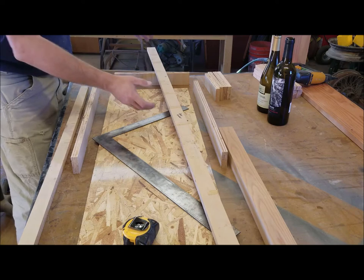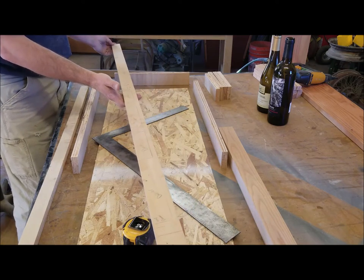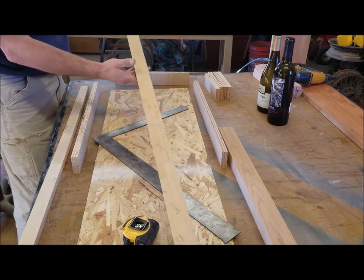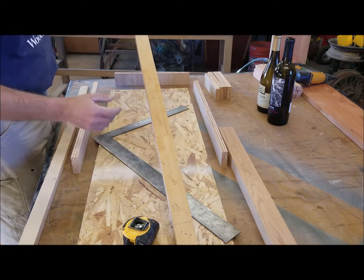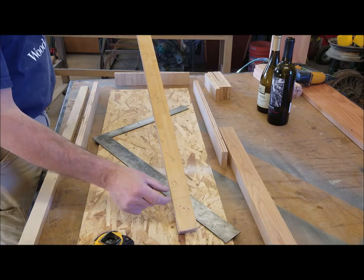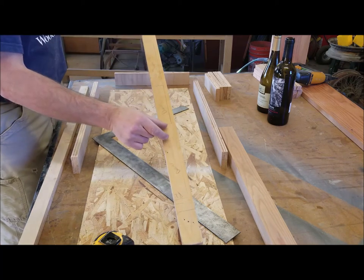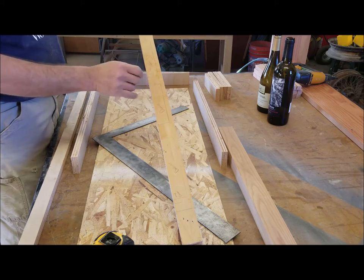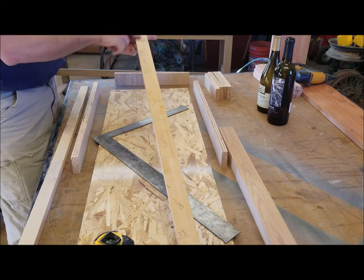It's huge. So for example, I make a story stick for every single piece of furniture or cabinet I make, especially if it's cabinets. So here's one for a cabinet I'm making inside my house right now. One side is the vertical direction. Using this as an example, here's the base, then there's some trim, then I've got drawer, drawer, drawer, spaced out. Inside here are the trim pieces. I use some quarter round or some bead molding inside, all the way up, top molding, and then the top.